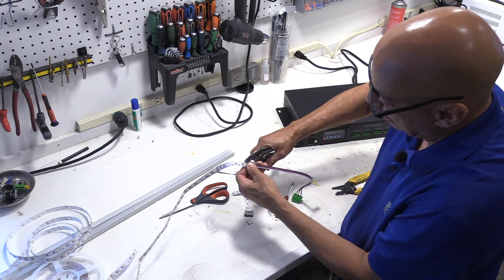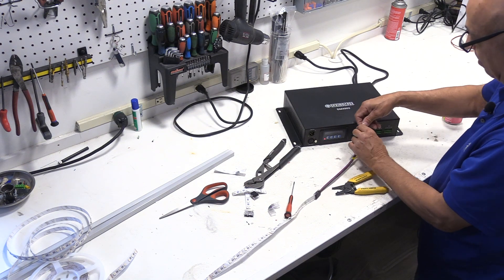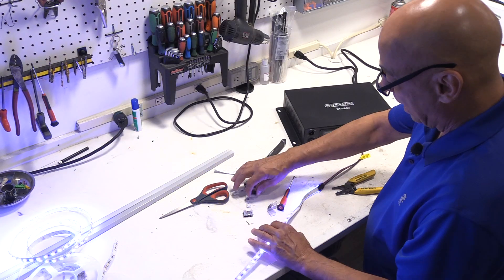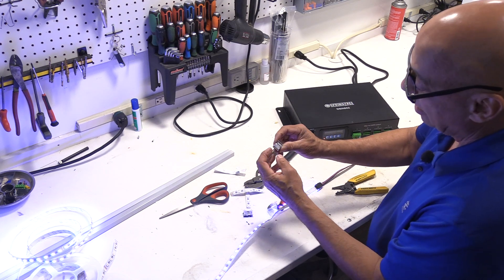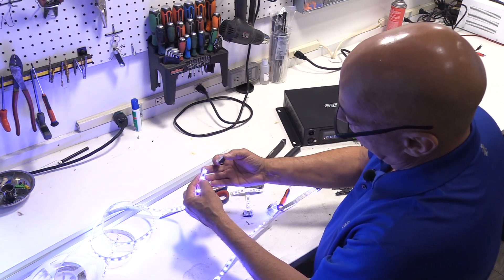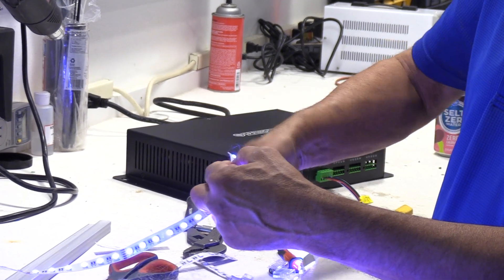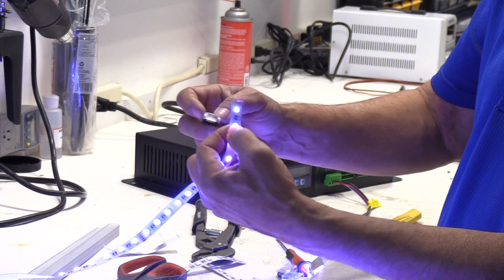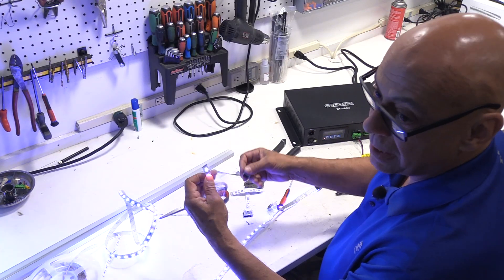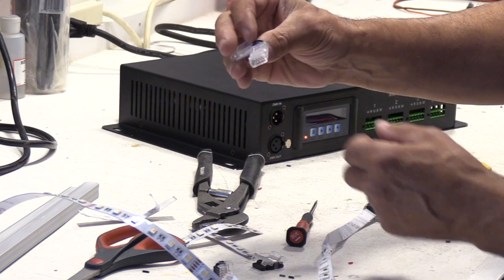If you were to mess this up, it's not the end of the world — you can always just go to the next line. If I did this right, we're going to get some lights coming on right now. And there you go! Same exact process with the splice connector. On the splice connector, when you go to the other side of the tape it is plus on the top, so when you get a new roll to splice into it, it must also be plus on the top so all the colors correspond. You'll do the same exact thing: peel back the two-way tape, stick it in, and crimp it down. I don't recommend trying this while it's still live — just unplug it from the unit while you do it.